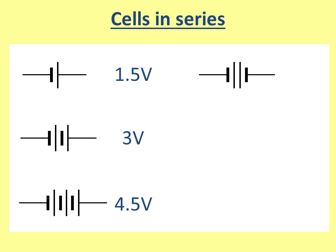This cell, however, is the wrong way round. If you have a look, the two positive sides are next to each other — this means both cells will cancel out and this will actually produce zero volts. Have a look at this combination of three cells and try to work out what the voltage will be. The answer is 1.5 volts, because the two cells on the right-hand side are canceling each other out, but the one on the left still remains and has a voltage of 1.5 volts, so the total voltage of all three is 1.5 volts.